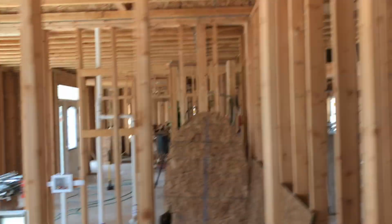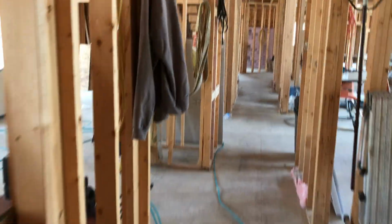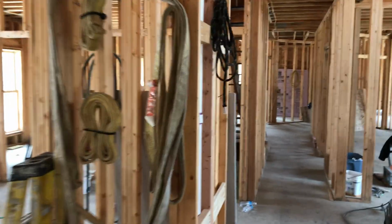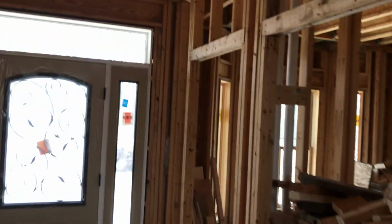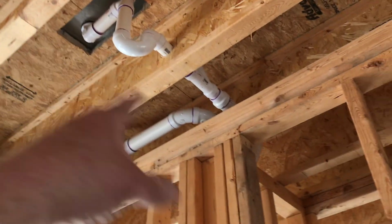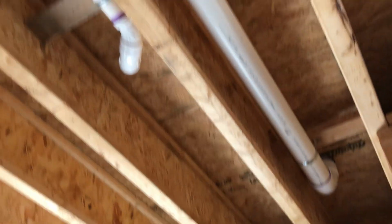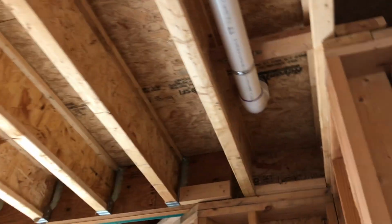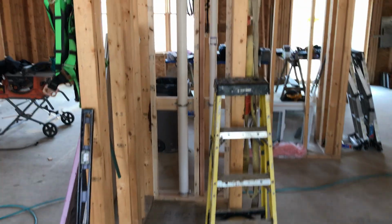And my point was, if you're trying to get under the radar of not doing a water test, the way I see it is, for that extra $180 and a half day of work of getting the water up there and a hose and all that, it's worth it to me to make sure that this stuff, especially up here on my 2nd floor, and all these pipes in the walls, are just not leaking, and we know for sure. I don't want to not do the water test, like I have to. This is a new build and it's required, but if you're just doing something a little shady on some smaller rehab stuff, even if you're not going to get it inspected, it's not that hard to seal it up and do a water test.